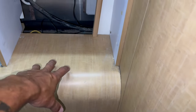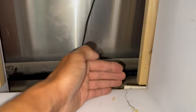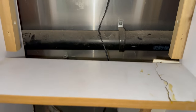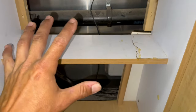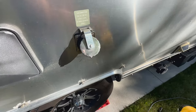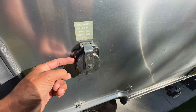Here in the bathroom of the Airstream you can see where the wheel well is. I removed the little piece of backing to this cabinet, and here's our shore power coming in. This will become the output of the automatic transfer switch, which is going to sit right here. I'll run a new wire from there into the transfer switch. The conduit coming in for the generator comes in right here where that PVC is. I'll just tie it up into the automatic transfer switch.